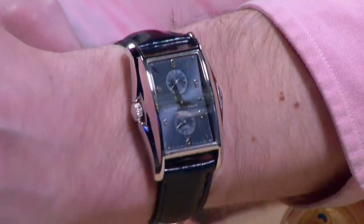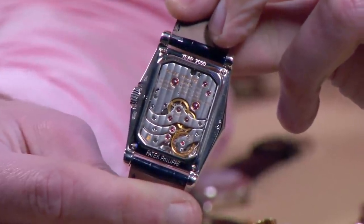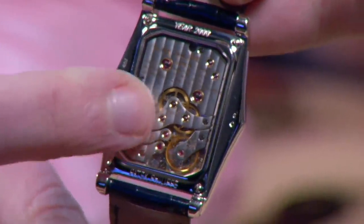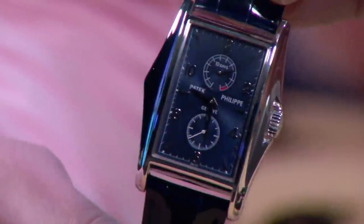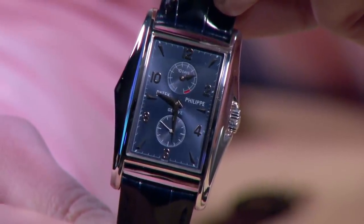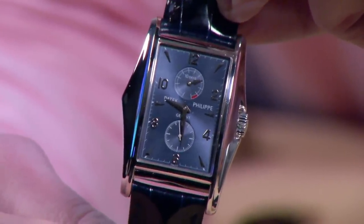They made 1,500 in yellow gold, 750 in rose, 450 in white gold, and 150 in platinum. Turn it over and you can see the caliber 2820 REC — 10-day power reserve, manual wind, Geneva Hallmark, finger-style bridges for the train like an old pocket watch, 9 jewels set in chaton including both mainspring barrels. Absolutely stunning — spellbinding with that sunburst blue dial and 10-day power reserve indicator at 12 o'clock. This is as good as Patek gets. Believe it or not, you can pick these up for less than people are paying for some steel Nautiluses. I would be all about this 5100G.